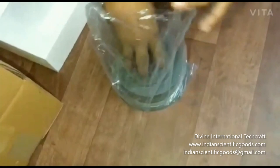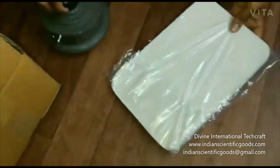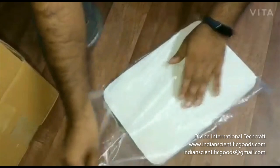The unit is recommended for yield testing, that is, determination of weight per unit area. The sample cutter cuts out rapidly and accurately circular specimens of 100 square cm, which is exactly 1/100th of a square meter. The result in grams, multiplied by 100, gives grams per square meter.